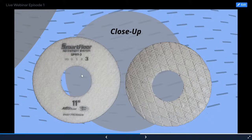And another thing to add with these double zeros is they are pretty aggressive because they're wet. So we're able to cut through glue, mastic, and other things that you're going to find on renovation floors. So don't be shy with them. They have very strong capabilities. The only thing that this system really doesn't do well, and I'm not afraid to say, is cut flat. So that is a pro and a con at the same time. If you have a wavy floor, it's going to ride the contours of that floor and still give you a decent polish, but it's not going to cut it flat. So if you're looking for tooling to cut the floor flat, this is probably not it. But you can cut the floor flat using other tooling and then switch to this tooling just fine.